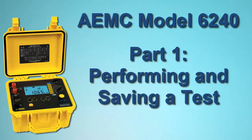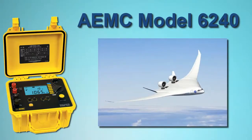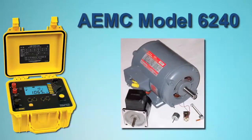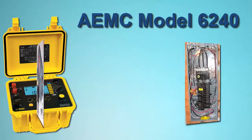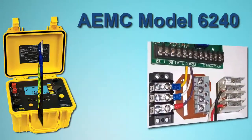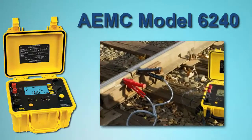AEMC Instruments Micro-Ohmmeter Model 6240 is a rugged, low-resistance tester designed for both indoor and field use. Typical applications for this instrument include measuring resistance for metallic coatings, especially in aeronautics, ground connections and continuity, motors and small transformers, breakers and switches, electrical cables, wire-to-terminal connections, and rail bonds, among others.